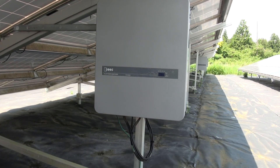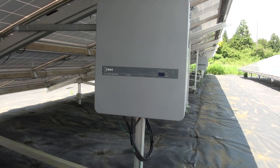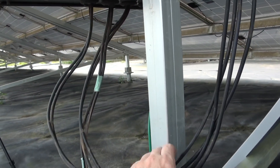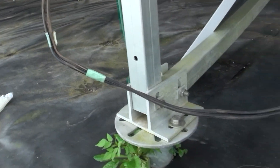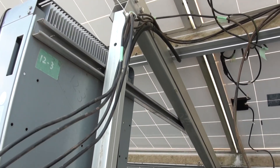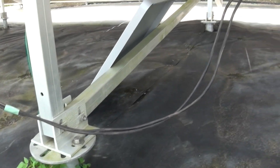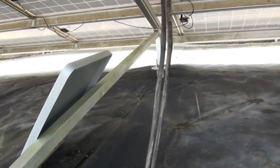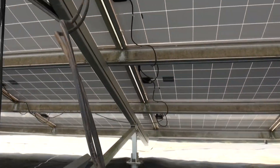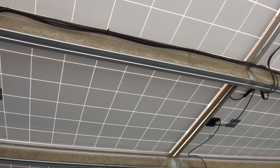The only other thing I brought today was cable ties. I'm going to cut the existing cable ties off and separate the cables out so it's easier to see on camera. This is input number two — I was correctly following it yesterday, but I somehow switched to following the wrong cable. That probably explains why none of those panels looked bad yesterday — none of them were bad. I was always a bit suspicious because they were bundled so tightly I couldn't see which was which. Now I can separate them out and follow this set of cables, identify the correct array of panels.